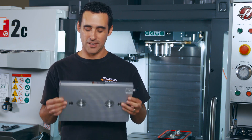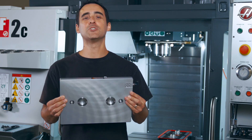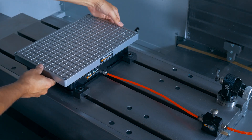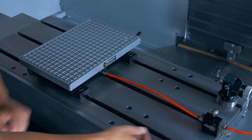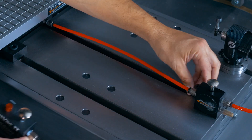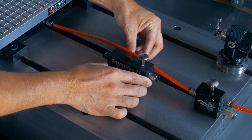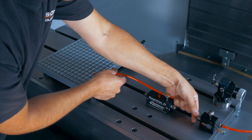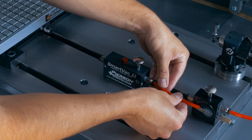Vacuum chuck on top, pallet on bottom. Let me show you how it all works. First let's take off this pallet and put on the vacuum pallet. Let's mount our vacuum power unit right about here, and change the airline from the base of the pallet system to the input side of the VPU.